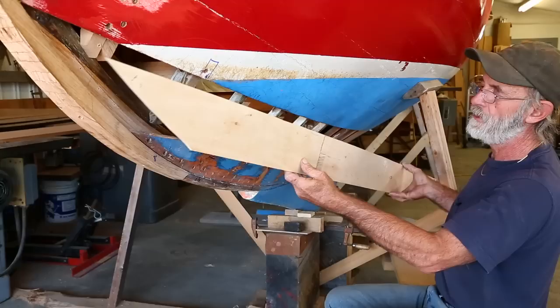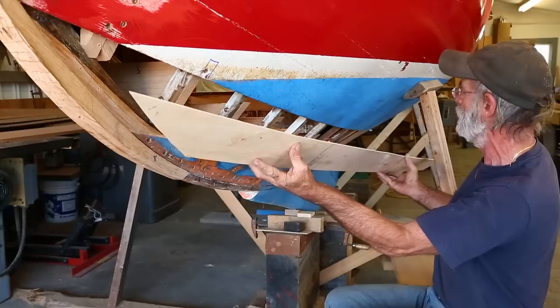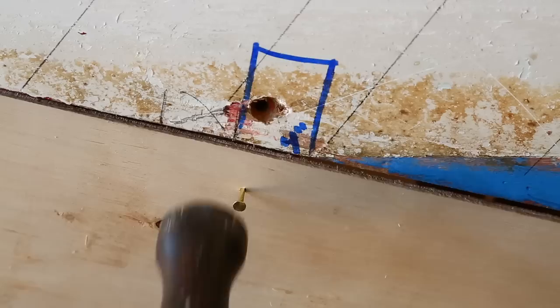It was a piece of quarter inch plywood, five plies thick, and I've run it through the planer just to whittle it down to an eighth of an inch thick, so it'd be nice and limber and set well into the background when I tack it in place. So I'm just about to tack it in place.